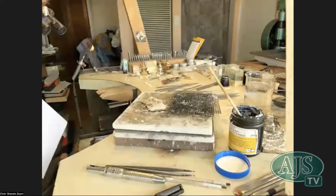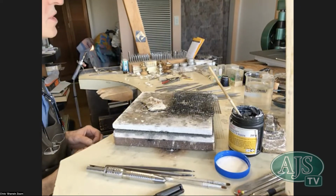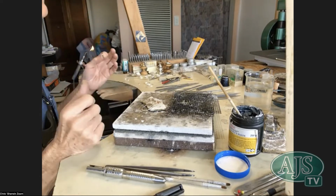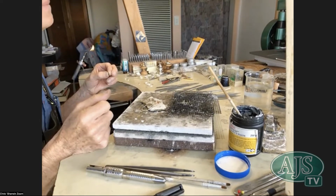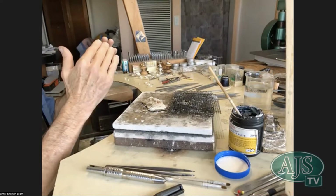And again, what's a good reason to use that joint then, Chris? So good question. The reason I will do this is because not only does it give you greater solder area and a much stronger joint, but it also allows you to really tension the ring out exactly as you want to have it. So by popping it inside, it actually pushes the bands outwards before you solder it. And it has this little excess of metal internally, which I can tap into so that you won't see the joint when it's finished. So it's a really nice way.